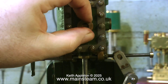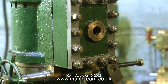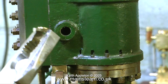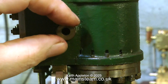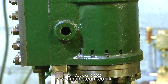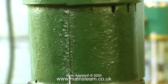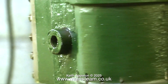When I look at these old engines for the first time I try to get into the mindset of the builder, and on this one I'm not quite sure what's going on until I look at the steam inlet and notice it's just a shallow bush pressed into the hole — and in the hole there isn't a thread at all. The exhaust was even worse; this bush was very shallow, it just fell out. I'm pretty sure the builder was supposed to drill these holes tapping size for 3/8 by 32 threads per inch, but I think he got confused and drilled the hole 3/8 of an inch, so instead of fixing it he just put a brass plug in. I may be wrong — I don't have a drawing for this engine.